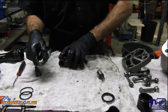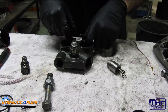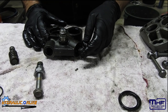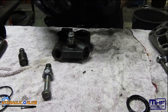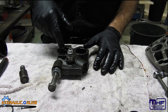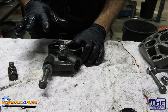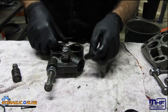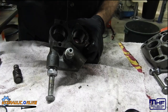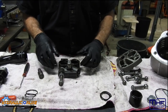The tricky part that allows this pump to constantly run while the engine is running is this bypass system. You've got suction and a discharge. This is a very light bypass spring. Normally when the system is running but not being asked to create any pressure, it's creating suction here, pressure's coming out here - pressure can't go anywhere so it goes into the bypass system. Some of it recycles back into the suction port and some of it bleeds off back to tank, so you've constantly got a replenishment of oil, and this is happening continuously while the engine's running.